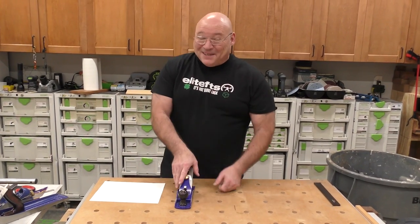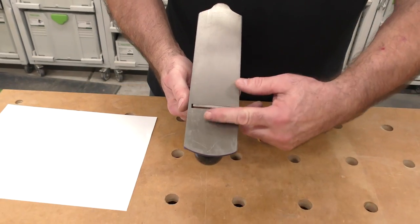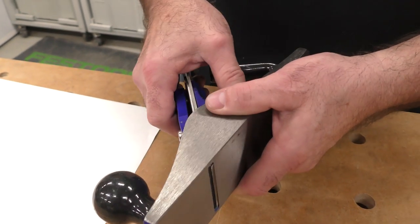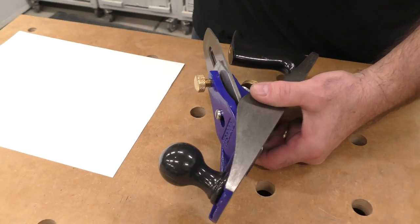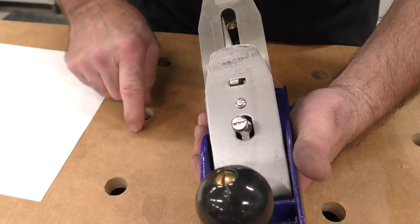The first thing I did was take it out of the plastic. Boy, that's the wrong way to package this — look at that blade sticking all the way out. I took the fine adjuster and moved it and went, wait a minute, that's as far back as it comes. So automatically I said: the frog is sitting too far forward.